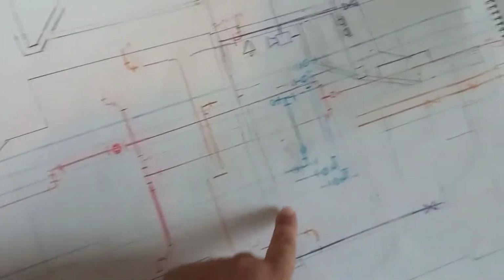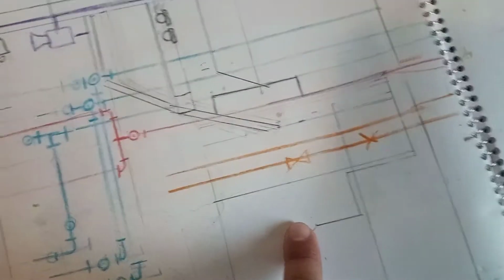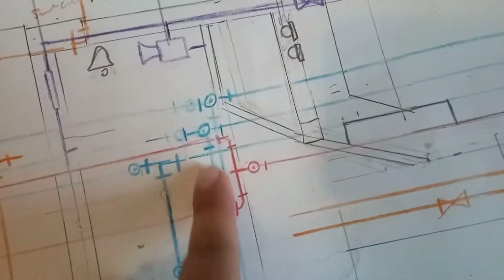And then we're going to flip back to this, the floor plan for the locomotive. This is the front, where you'd have a sandbox, and here would be the heater. Notice the control stand on the left and to the right, and then the brakes going up into here. Bell valve, brake cylinder valves.